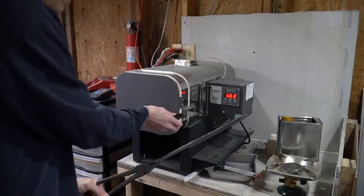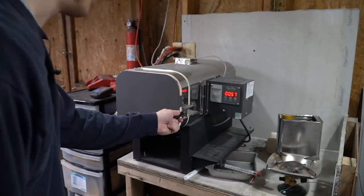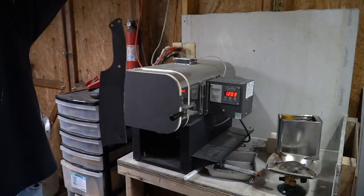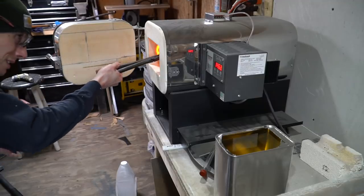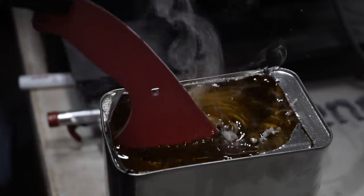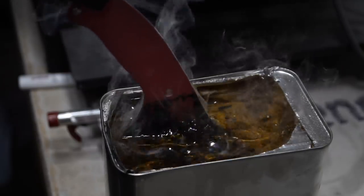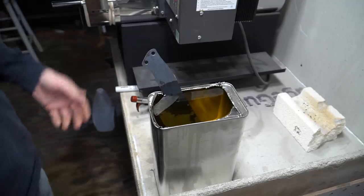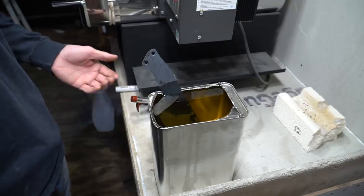The shop's a mess. Putting this back in at 1200 degrees — last cycle. This thing's so hot. Now I'm going to take us up to the kitchen oven and we'll do two two-hour temper cycles at 400 degrees.